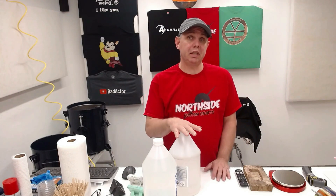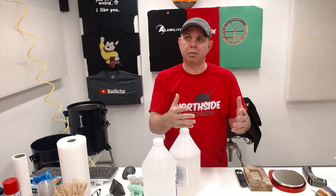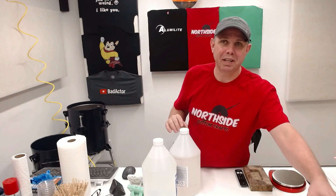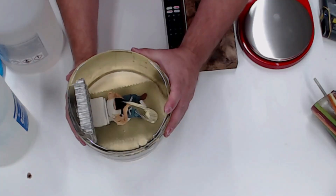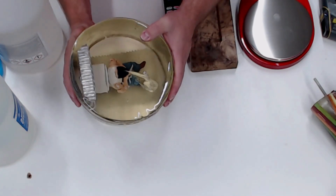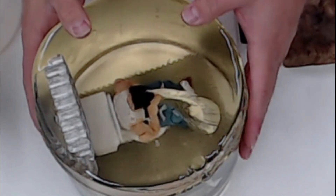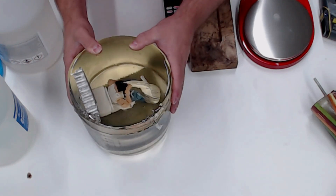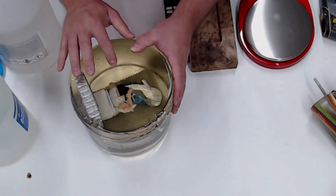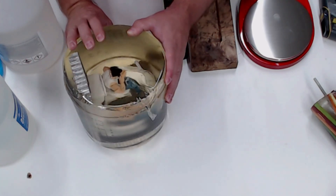The first thing we're going to prove we need to watch out for is air, and I'm going to do that right here on a past piece. With any kind of resin or epoxy, air is a problem — it looks like foam and tries to come out. Here's the biggest failure I've ever done. This is a Wolverine project on my channel — it turned out fantastic in the end, but the lesson I had to learn was it had air inside of him. You can see the big void that came out. I left him in the pressure pot for about three hours, and as soon as I opened it I could see the air come out. His body was hollow and I didn't know it. So if you're trying to do a cast and you have air in the thing you're casting, it's not going to turn out pretty.